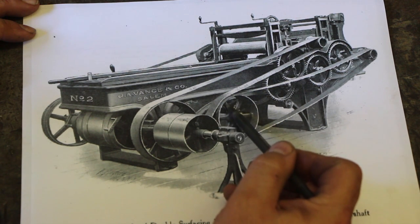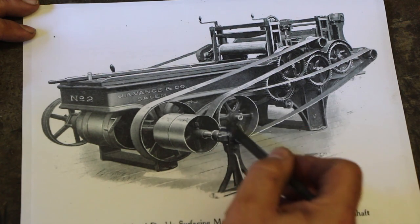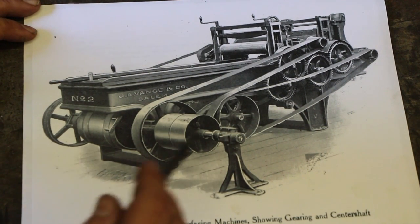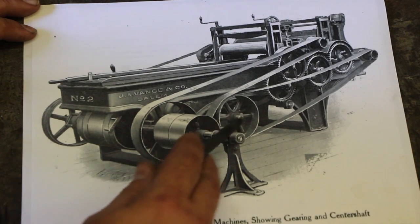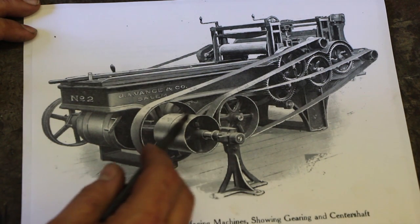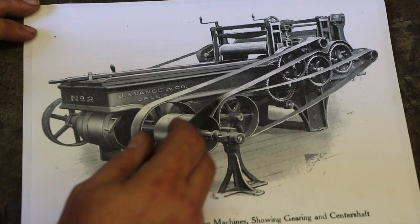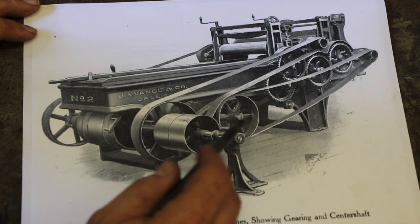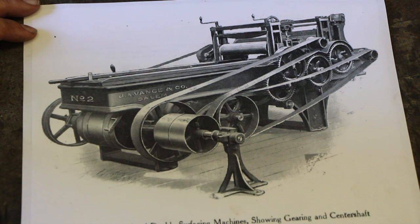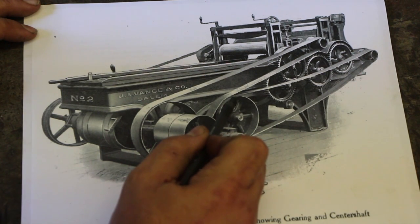So initially I thought that the whole purpose of this shaft and belt system here was to just put that little crook in there to give you that extra friction on the pulleys, but in reality it's also driving the outfeed cutter head on the machine. So again, these need to be the same diameter to keep the speed of this pulley here going the same on both sides. However, because you've got this belt going around here, you actually have a little bit of extra thickness around that. So when you're looking at that matching pulley, you need to add the thickness of the belt.